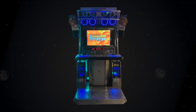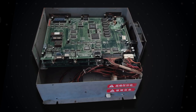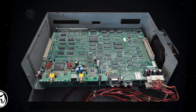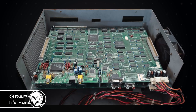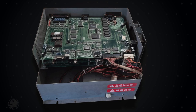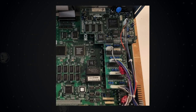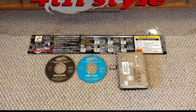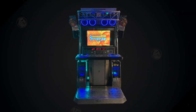Beatmania 2 DX also used PlayStation hardware, called the Twinkle System. Whilst on the surface it looks like the 573 could have been used, I don't think it was — partly because the game required a lot of extra hardware. Firstly, it needed an extra graphics board to allow overlay of gameplay on top of live video from VCD or DVD, and the 573 expansion connector had no video signals. Secondly, it used a second audio board to play music with DSP sound effects mixed in. Though the 573 did get a digital audio board, it had no DSP functions and was released a year after the first version of Beatmania 2 DX. The original Twinkle System used a game program CD, a hard drive for audio, and a VCD or DVD for background video — a game the 573 just wasn't designed to handle.